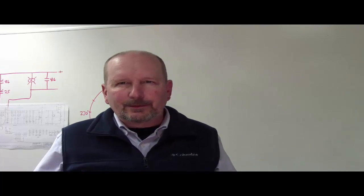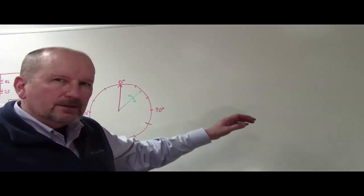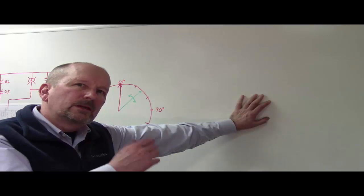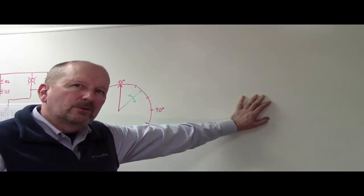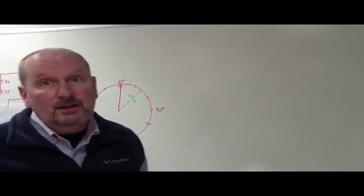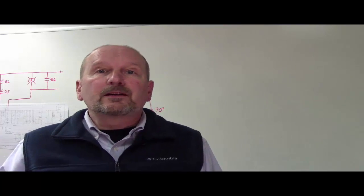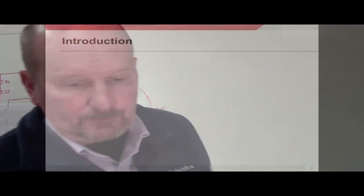Normally I don't like to put my hands in my pockets — it looks unprofessional — but in a substation I'll make an exception. Think about this: I put my hand against a steel structure out in the yard. What are the chances there could be a stray voltage in that structure that could cause current to pass through my body? It's not inconceivable. Inside the control building there's exposed control wiring, a battery, and all sorts of things. There is no benefit to touching anything, so when you visit the substation, do not touch anything.